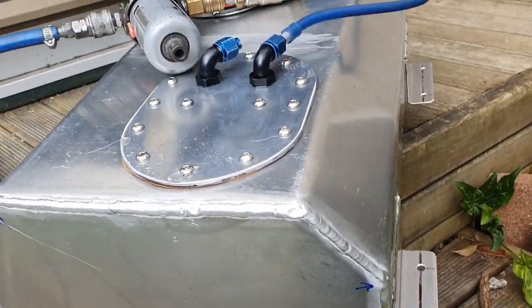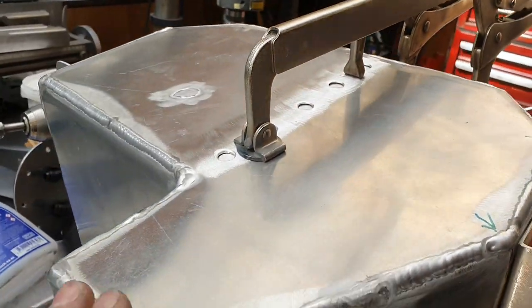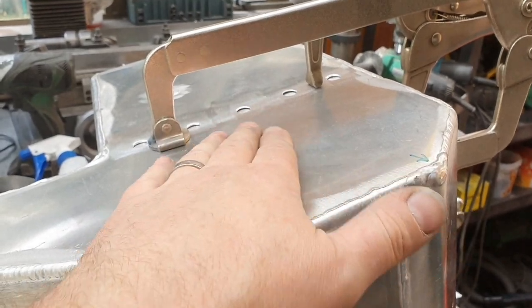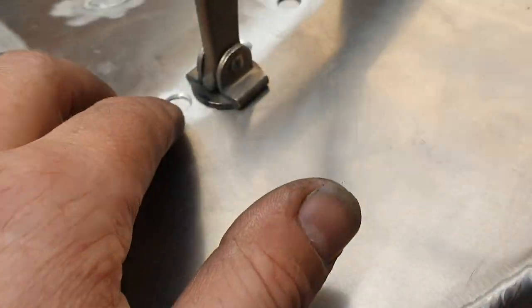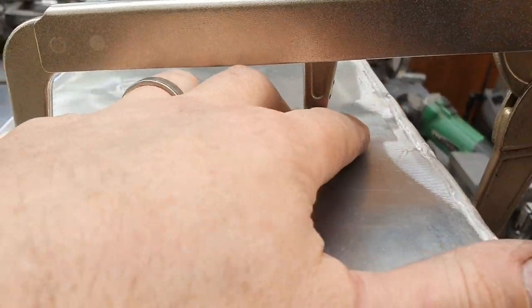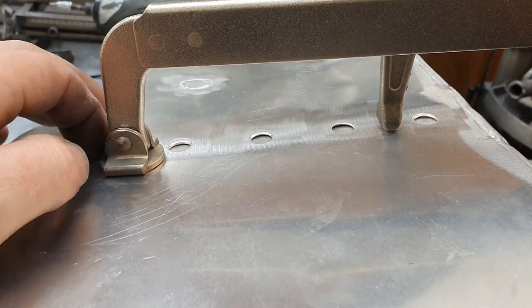Quick tidy-up of those welds, retest, and we should be pretty good. We passed the leak test and the weld test. The plastic deformation test — not 100% happy — there was slight deformation on the end tanks and a reasonable amount underneath because it's a larger surface area. So I've added some brackets on the inside — there's a stringer, frame, or structural reinforcement there. It only weighs a few grams, so that's fine — we'll lose a few mils of fluid capacity but whatever.